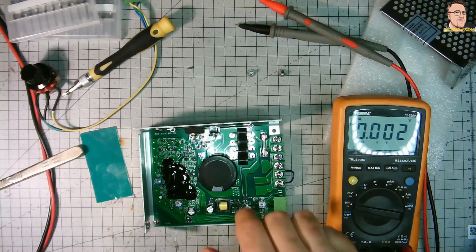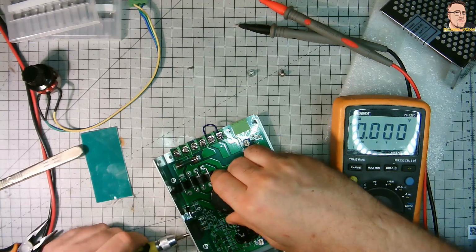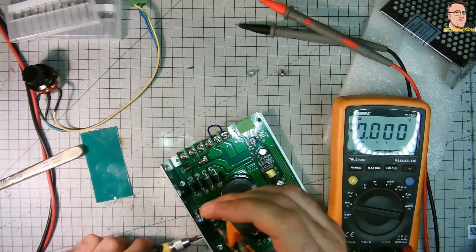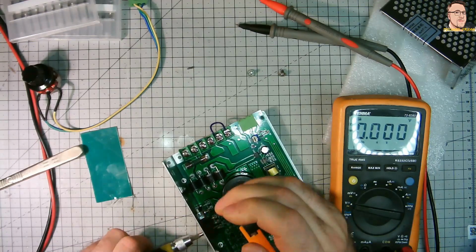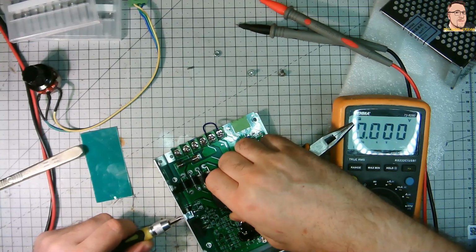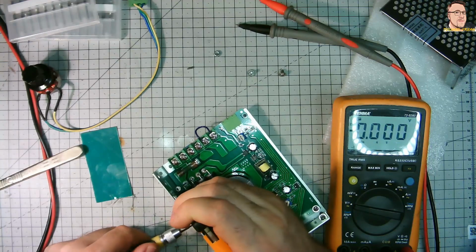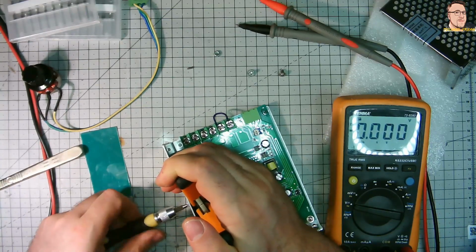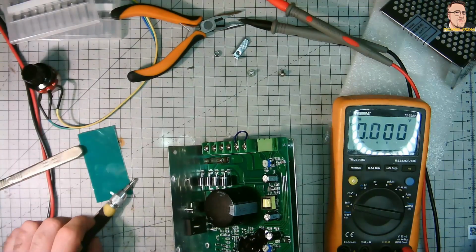We got just two power components, but they are connected directly to the capacitor. If you could see these big traces going from this black barrel which stores your energy, and is connected straight to those components. And at this moment, that sheet of plastic which is there provides you some insulation, but the first problem is it's not properly thermally conductive. It's like using thermal paste for a processor in a PC to make a good thermal joint.